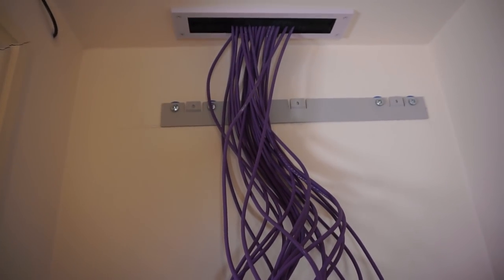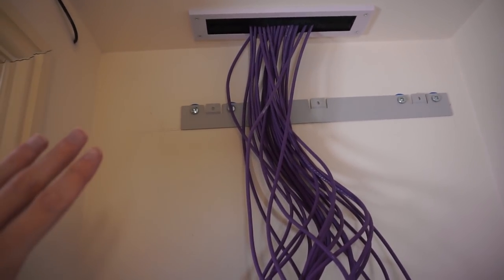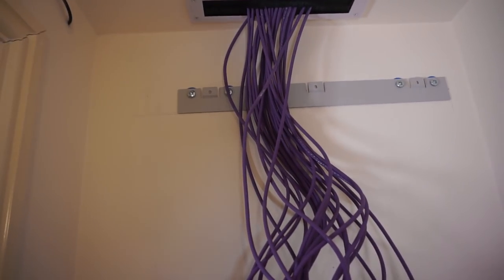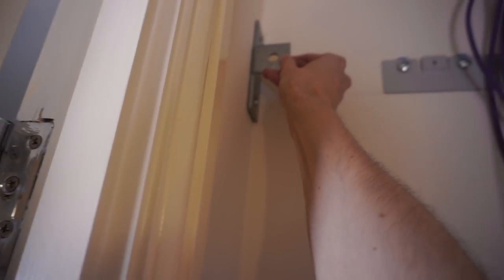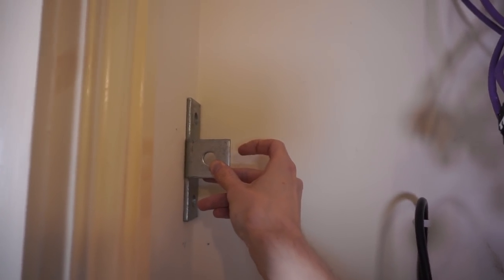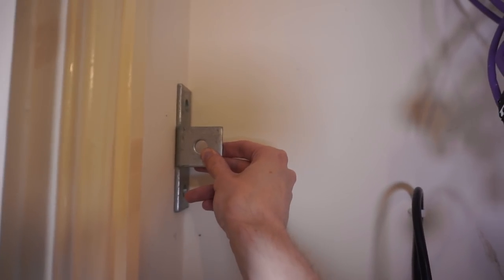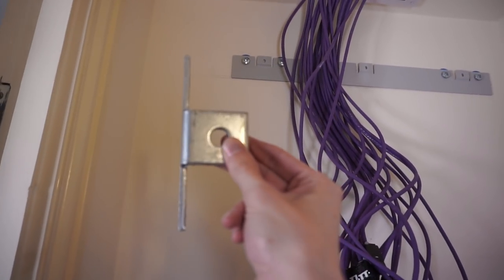And yeah, so that's there. So what I'm going to do now, I'm going to take that bracket off. I'll probably take the grippets out as well, just so the new stuff can fit flush to the wall, because the grippets protrude maybe 1 mil from the wall. And then I'm going to mount the struts across. So first thing I'll just do is I'll get all that off, and then off camera I'll get these angle brackets in. I'll be basically putting one there, one on the other side, and then I'll do another strut sort of wherever the bottom of the cabinet is. The cabinet won't actually fix to that, but it'll just space out from the wall correctly. I mean, I can maybe drill a hole in the back of the cabinet to secure it with a screw, but it just sort of spaces it off the wall correctly. So, yep, time to get that bracket off, get the grippets out, and get these brackets installed.